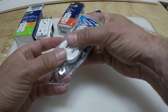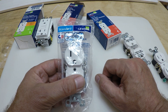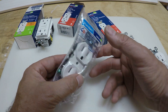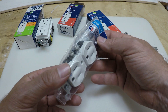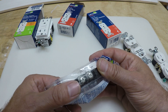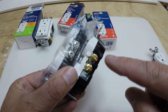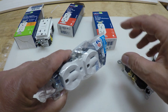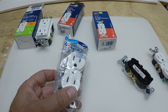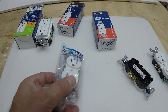Finally, we have what's called a COALR outlet, which is a copper-to-aluminum outlet. Inside the package — I really don't want to open it because I'm returning it — look at the color of the screws. These are coated to be able to accept aluminum wire.